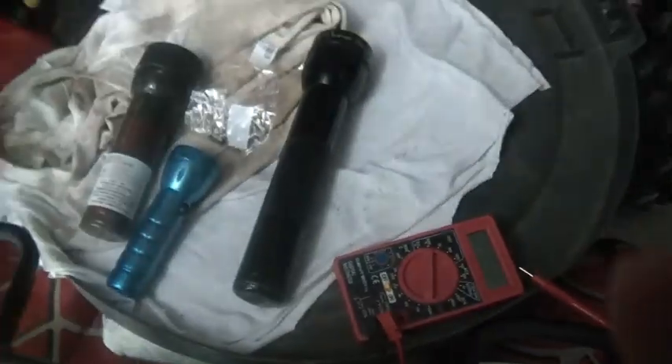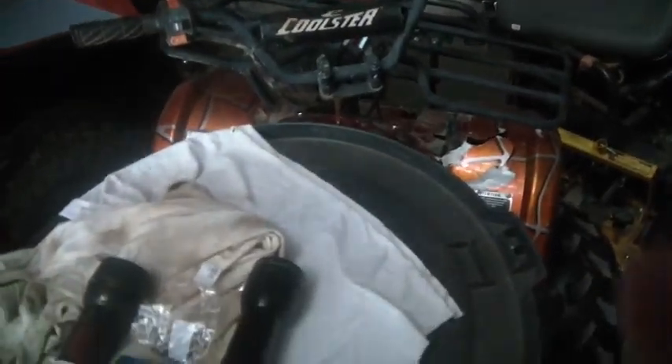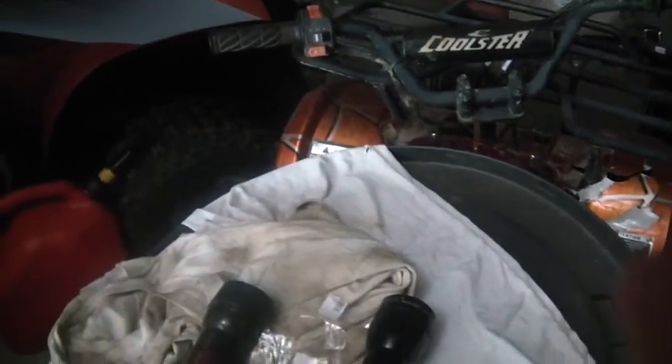This was the OEM light bulb — your typical Edison filament type bulb. It used 700 milliamps worth of current, and if you multiply that by three volts, that's about 2.1 watts.